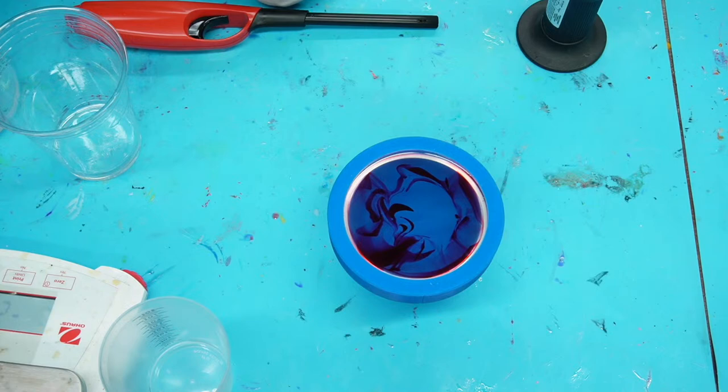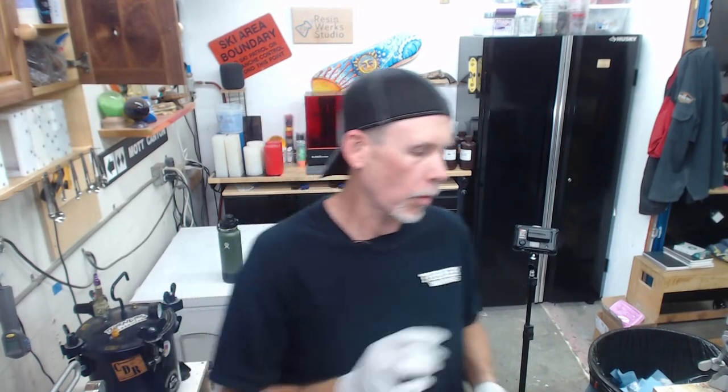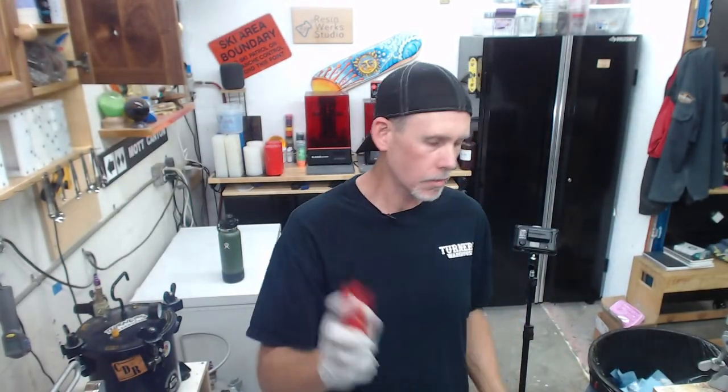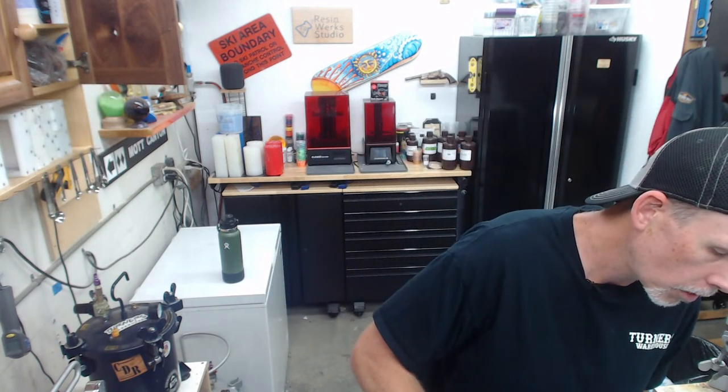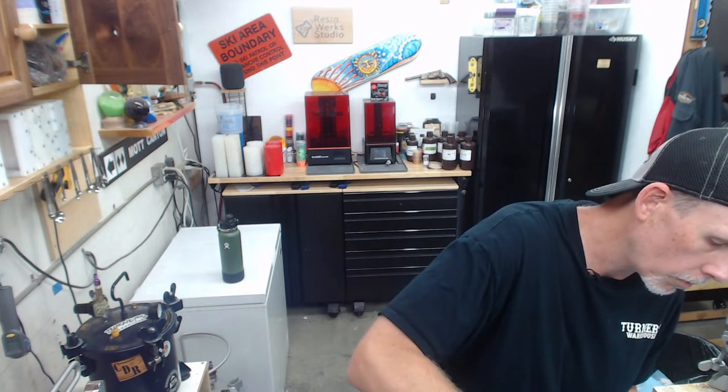Yeah, it is. It's okay, but the thing is those butane lighters are focusing that heat in one place, and it can really wreck your molds. I really highly recommend not doing that. It's mainly these little butane ones, they get really hot. The bigger torches that produce a wider flame, it's mainly the heat and the focus of that heat. These generally are going to work a little bit better for you, and you don't have to worry about causing any issues on your molds.